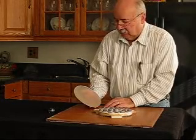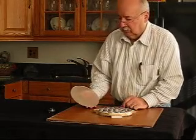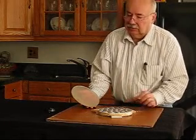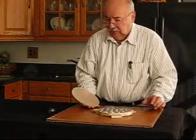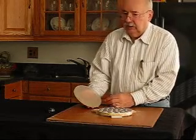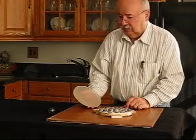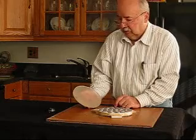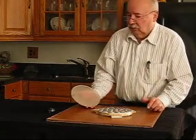What about center thickness? For a mirror you want to leave as much center thickness as you can. For lenses, most amateur telescope projects aren't really that critical for center thickness, but you need to know what it is and maybe plug that value into the optical design. You may need to tweak the radius accordingly. For this mirror the radius is fine — it hasn't changed much during grinding — but you need to be aware that the radius is critical and can change.